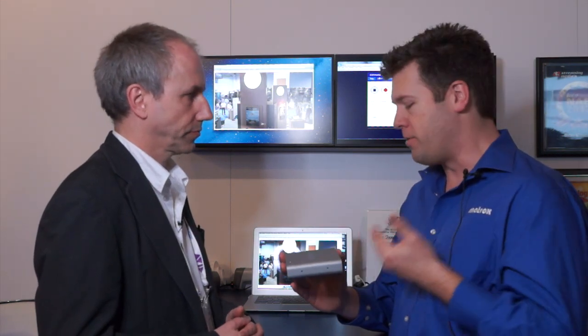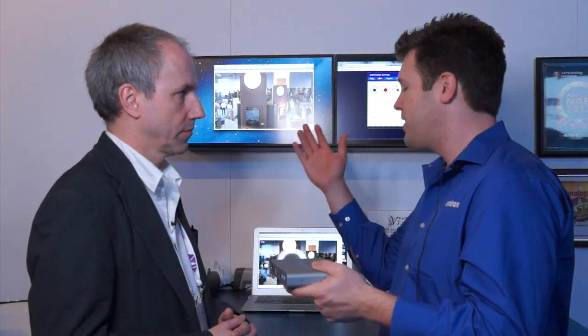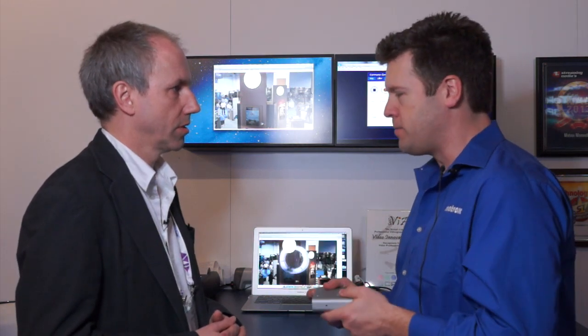Live streaming is very important to reach your audience, but many audience members don't actually view that stream live — they'll go download the VOD. With this product, you can stream at whatever bit rate your upload bandwidth will provide. We take up to 1080p 60 input; you can stream that at up to 1080p 30 at 20 megabits per second, but most likely you'll be streaming more like 720p at 1 or 2 megabits per second. The device has a completely separate channel to record at up to 30 megabits per second — that's Blu-ray quality — locally to the SD slot, USB 2 drives, or even to a network-attached drive on a computer.